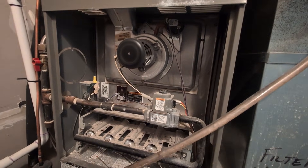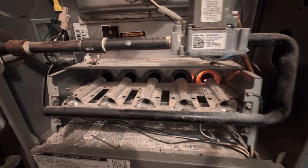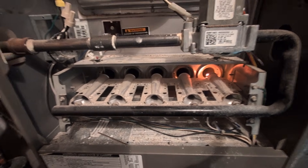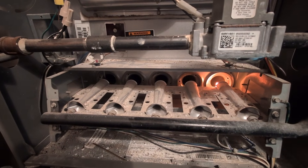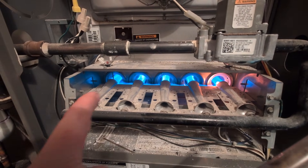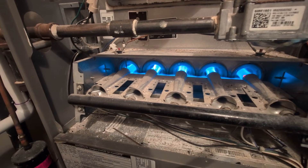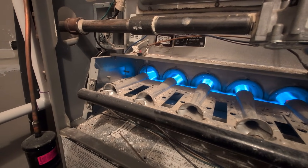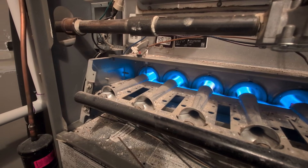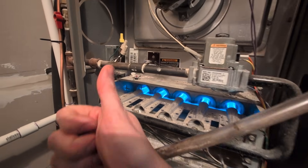We're going to pop it back in and turn the furnace on. We've called for heat, so the fan is on now, blowing air. There it goes — that is igniting right in front of the first burner. Then you might hear a click and the gas will come across the manifold one burner at a time. There you go, you saw it go. Now this one on the far end is where the flame sensor is, newly cleaned off. As long as it's detecting that flame, it will stay on pushing hot air into the house. If it cuts off, we'll know that flame sensor has not been clean enough or there may be something else wrong, but it seems to be holding on nicely. I'd call that another repair in the books.